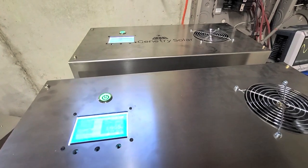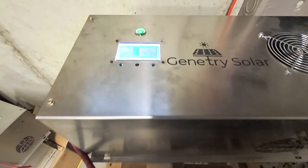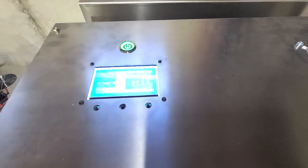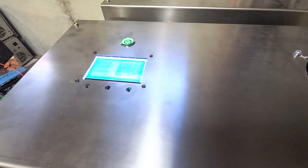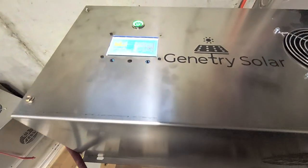Surge loads, however — there's the well pump just kicked on. My central air upstairs is actually running and the well pump just kicked on. So combined between the two, you've got about five kilowatts right now between the two inverters, and they are in fact sharing the load.